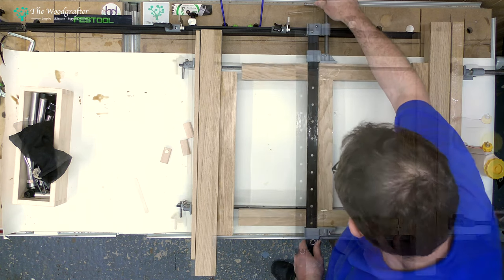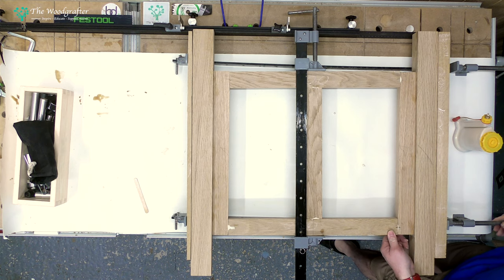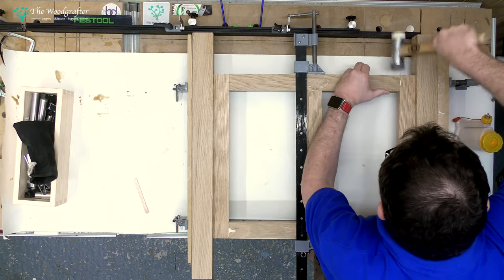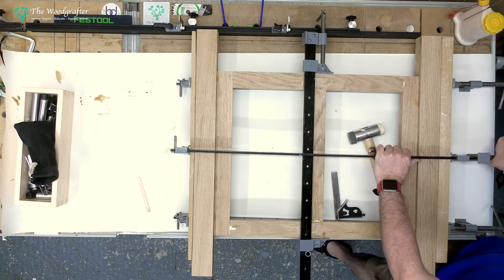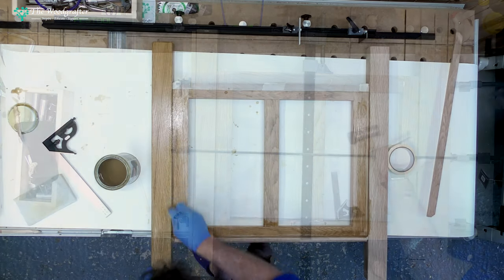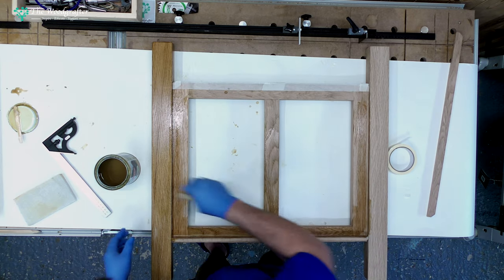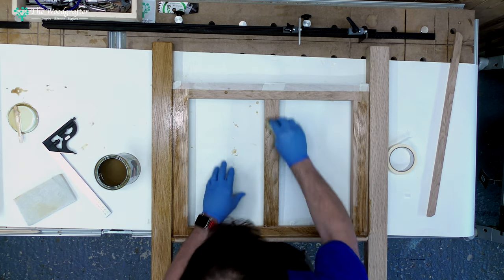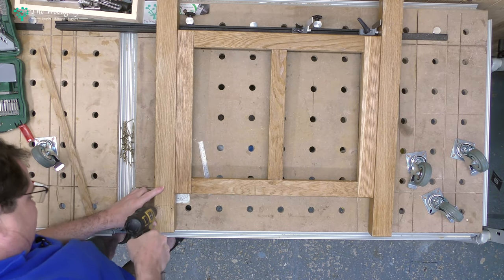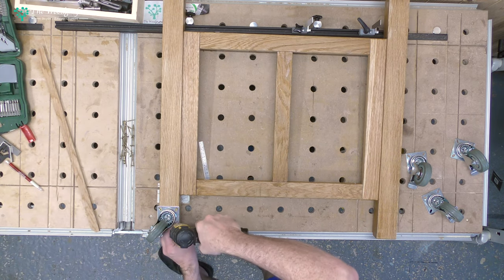I start with the middle frame, gluing up that H piece. I then bring in the end assemblies, bring everything up nice and tight but not too tight. I use a hammer to bring the frame into alignment, making sure it's all smooth, and then clamp everything into its final position. A couple of coats of Osmo Poly Finish, as always in my workshop, finishes it off to a nice high sheen. I leave that to dry overnight, then drill some pilot holes and screw in those all-important casters.